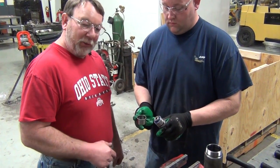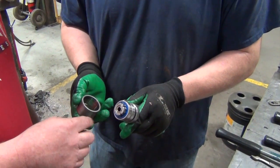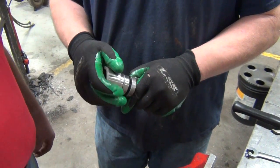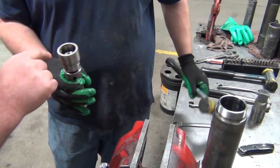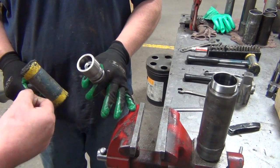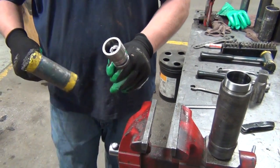We're ready to install our eccentric weight into our eccentric housing. Once you've found the hex with the least amount of play in it, you want to insert the 655 over top of the bearings with a plastic face hammer and make it almost flush with the top of the bearings, and then insert it into the eccentric housing and, using the same hammer, finish inserting the bearing into the eccentric housing.